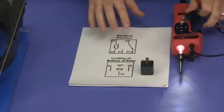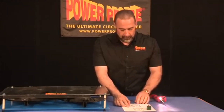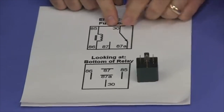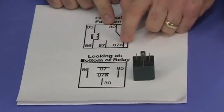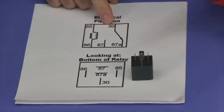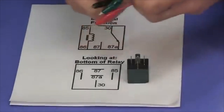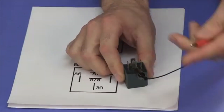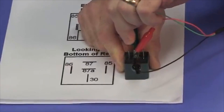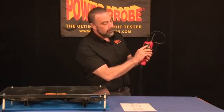What I have prepared for you today is a picture of the electrical diagram of a relay, the bottom view of a relay, and an actual relay. If we take a look, we see terminal 30 is the common terminal that will go from the normally closed to the normally open contacts. That's where we would connect the black lead, which would feed those two terminals, and then the red and green would go to the normally open and normally closed contacts. Let's take the relay and connect the black, which is the common. The other two connectors — the red and green — go to the normally open and normally closed contacts, and we can see the red LED is already illuminated, showing the normally closed contact.